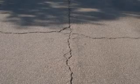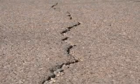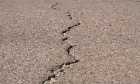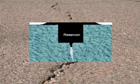The first method is crack sealing. This process should be performed on pavements that are in good condition. Good condition is defined as a pavement with a sound base that exhibits distress in the form of thermal or working cracks spaced near or over 10 feet apart. The procedure consists of routing and sealing transverse cracks in order to prevent both moisture from entering and deteriorating the subbase and incompressible material from interfering with thermal movement.